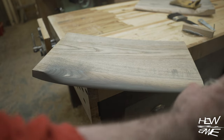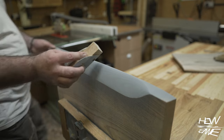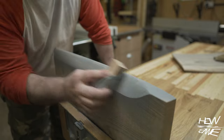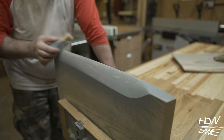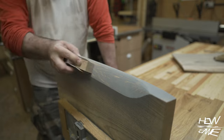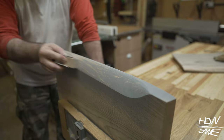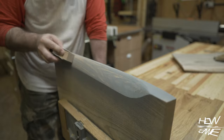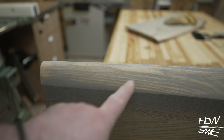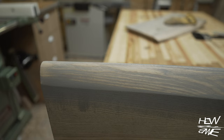This trick I learnt from working on my car doing the bodywork. Basically that's spray paint — you can use any spray paint you like, it doesn't affect the wood. It's basically called a guide coat. Then you use a flat block — not soft or spongy — and then they call it blocking. Block your surface with long strokes. Your block will be surfing off the top of the high points, and where there's paint still remaining, that's showing you the low points. So you can see there are three high points in between, and I need to block down to get it all nice and smooth.